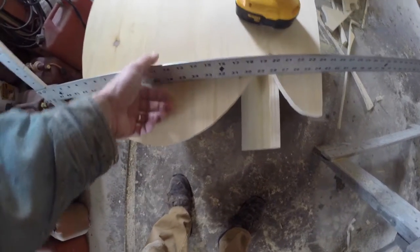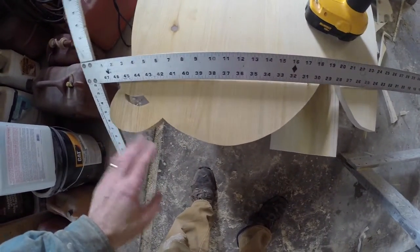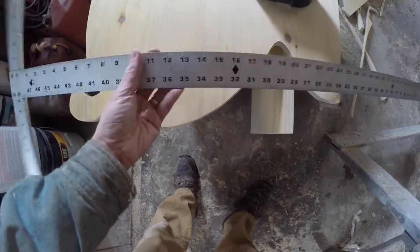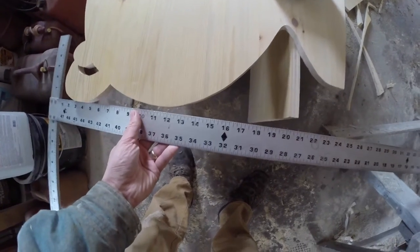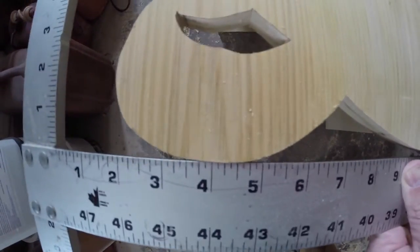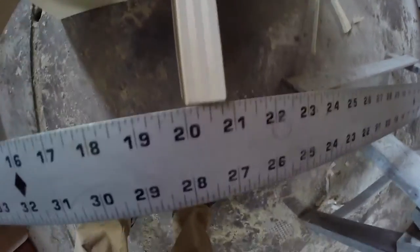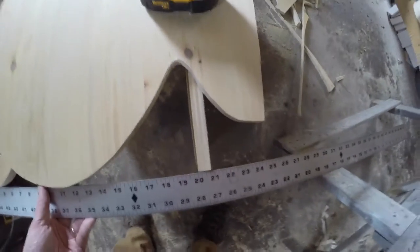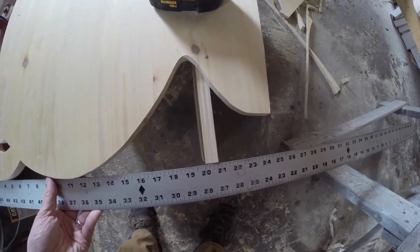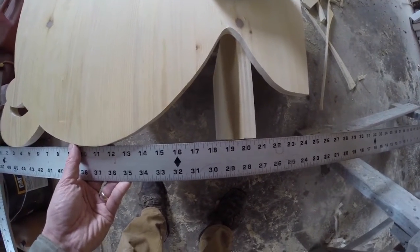Even though you're following the diagram, you may have cut just a little off. To be safe, take a straightedge and check that everything is level. If it's just a little bit out, take that board and move it down slightly, then screw it in place so the chair won't rock when it's in that position.